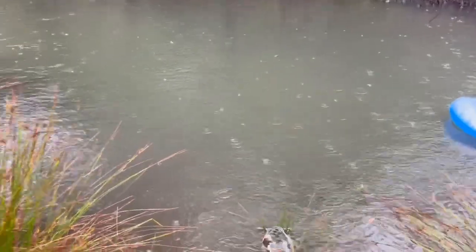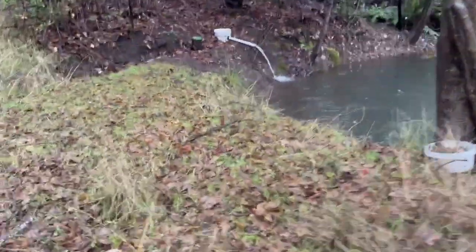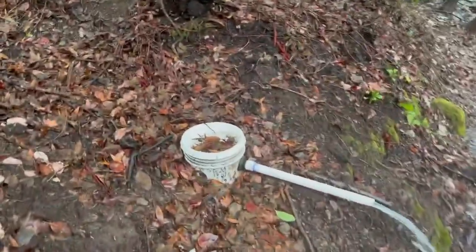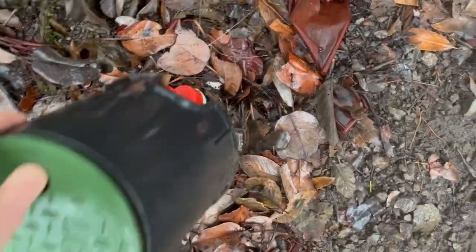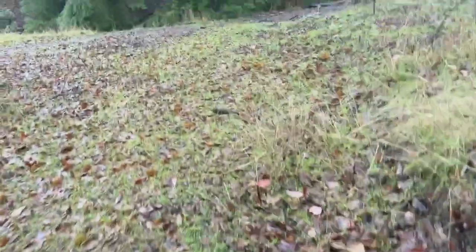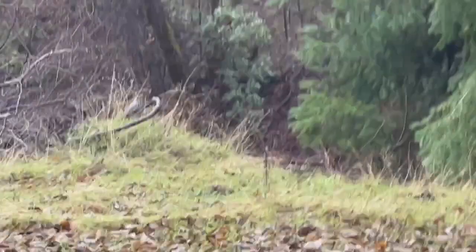It's actually having a hard time keeping up because you can see it's starting to come over the berm here a little bit. I think what we might wind up doing, if the storm continues — which they're saying it is — is actually moving the water that's going into this bucket, which is our spring settlement pipe. From here it goes down here. Right now this valve is off, but if I turn that valve on, a lot of this water will get shunted around to our holding tank down there and it will go out the overflow of that down into the creek.